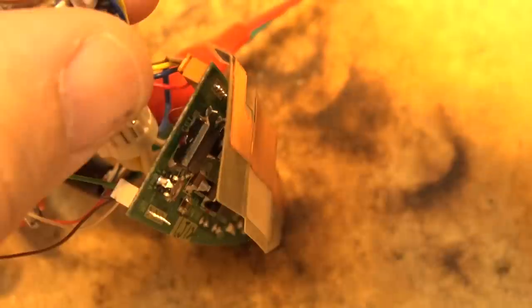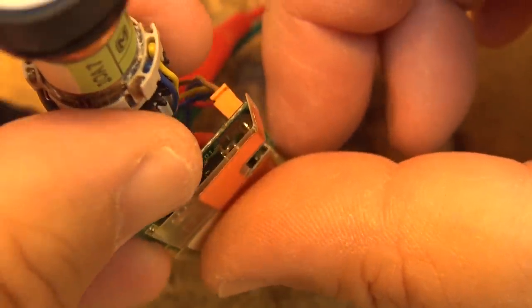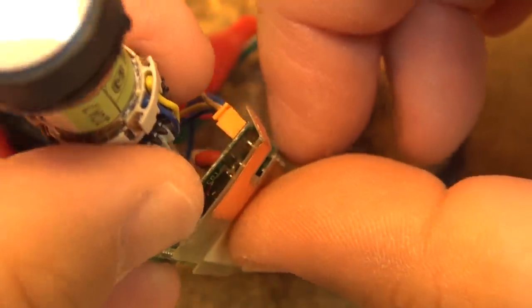If I hold the shield up against the bottom of the board, the interference goes away — it must be my little AM transmitter running nearby. There's a little shield here, and holding it against the bottom of the board clears up the interference. That's probably why they had that shield there, because this is prone to interference.